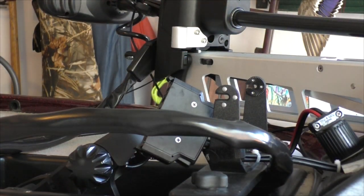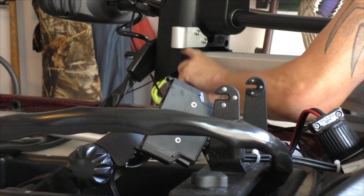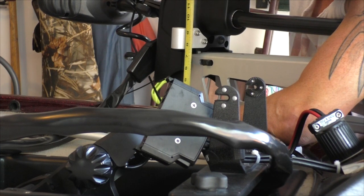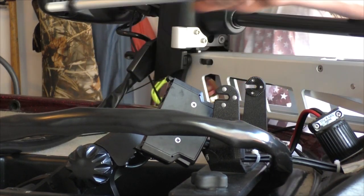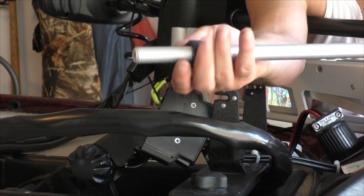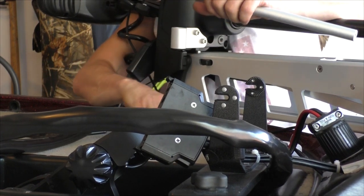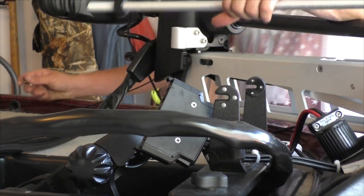What I forgot to tell you — you've got to put your brace on. For a big deep-V that's why they have this big brace piece. I'm going to measure — we've got about seven and seven-sixteenths inches. So I'm going to cut this bar to seven and three-eighths with a hacksaw. That gives a little bit of play because you've got this nut here that you can adjust the height with. I'll install that and that'll be the last part of the install.